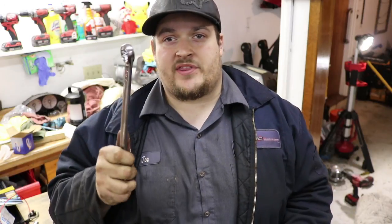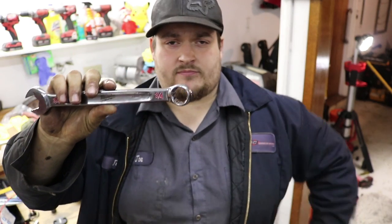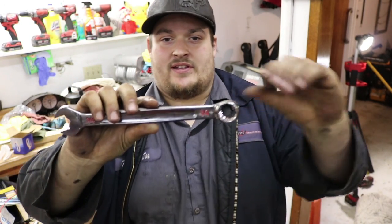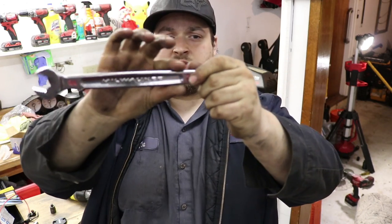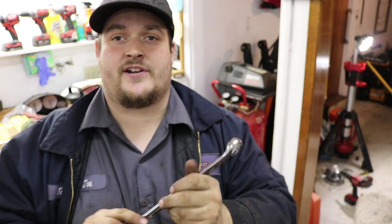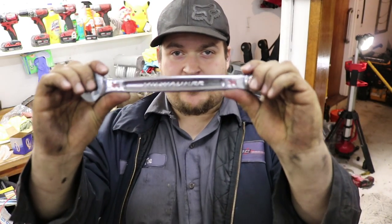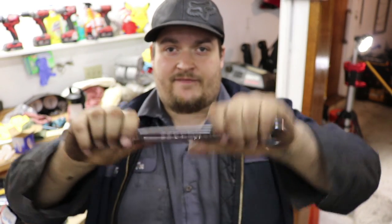Now the closed side works great, as most wrenches do, but where these really come into play is that I-beam strength. I talked about the I-beam strength before — it gives you this indent with a little thicker material surface. The wrench isn't heavy; it's still about equal weight to everything else out there, but it gives you a huge strength advantage when you're forcing on it. It's the right angle — it's just not going to flex. It's going to put your power to the fastener where you want it; you're not overworking it or twisting and causing it to move off.